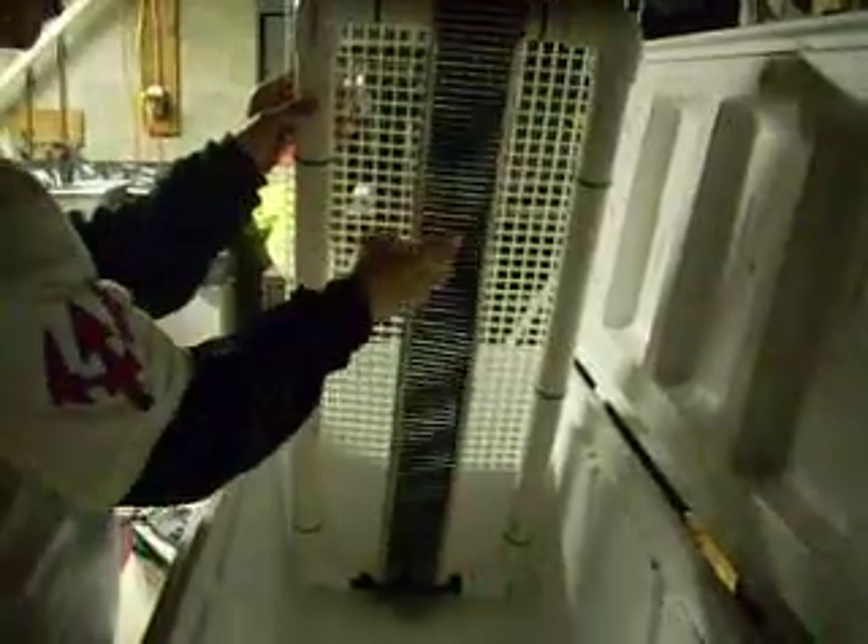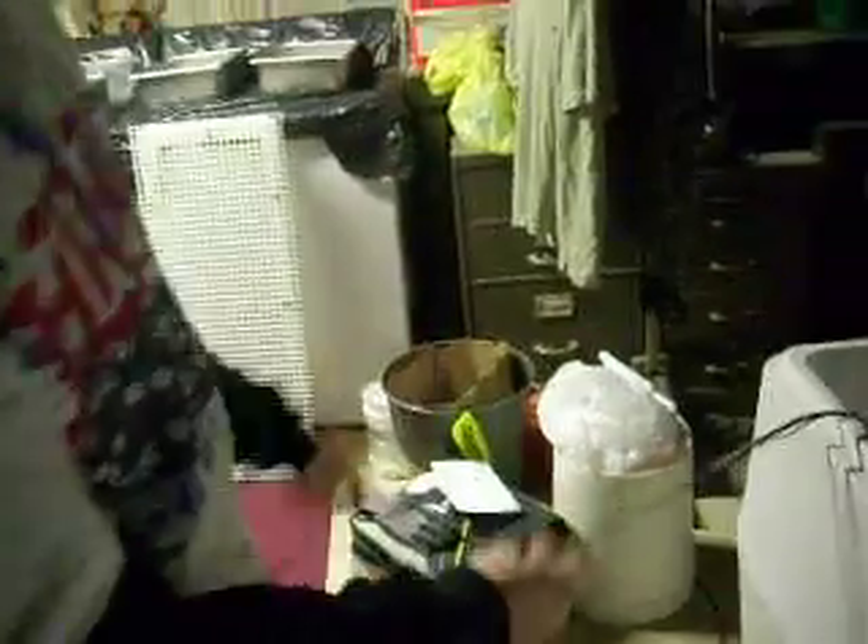You cut the egg crate to the size of the frame. You make the frame out of PVC and wrap the heat tape around it so that it doesn't touch while it's laying down. Then you take the egg crate and cut it to the size of the frame. The frame fits exactly, perfectly, inside the incubator. All the wires come out of the drain hole — there's a drain hole right down there — and the two probe wires come in through the drain hole.